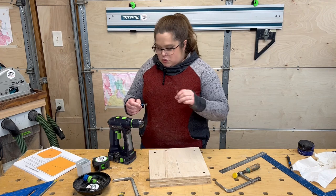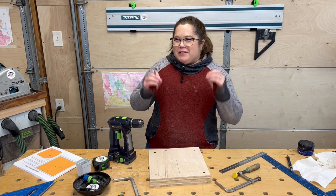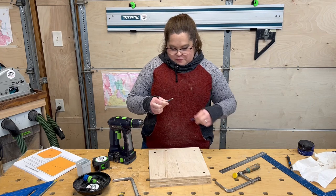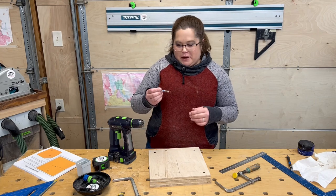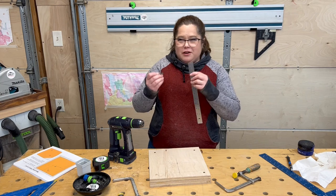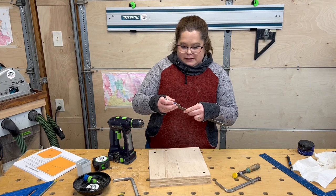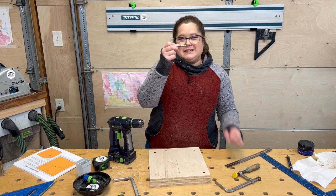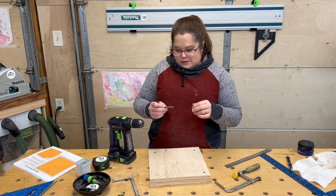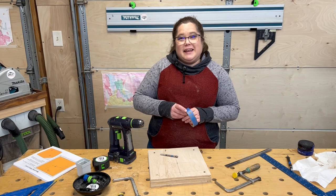I've got my two points where these two lines cross — that's where I'm going to drill the seven sixteenth hole. This is going to be for the hardware listed in the plans. I am going to drill a hole one quarter inch deep. The trick I'm going to use — though I'm still feeling a little concerned about it — is to give myself a little tape flag to tell me when to stop. A quarter inch is not very deep, so basically when I get to the top of this part of the bit, I'm supposed to stop. I'm going to do the tape — I'm not sure it's necessary, but I'm going to take any help I can get.